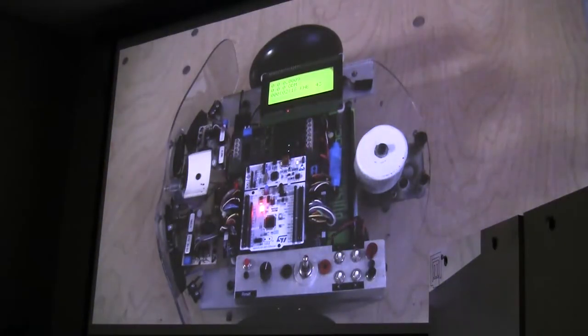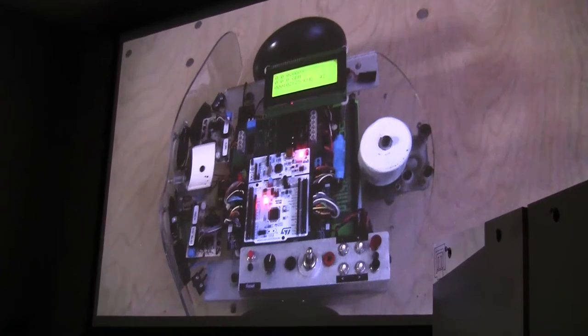I have to describe something that's a little bit arcane in order to explain what's going on. This memory all runs out of flash. And so when you hit reset, two things happen. The reset function sets up the initial stack pointer and initial program counter. It cleans the BSS section of memory.